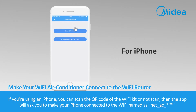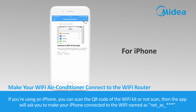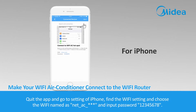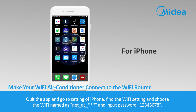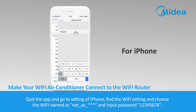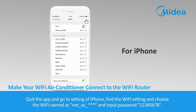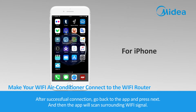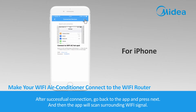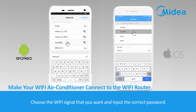If you're using an iPhone, you can scan the QR code of the Wi-Fi kit or not scan. Then the app will ask you to make your iPhone connected to the Wi-Fi named as net_AC_. Quit the app and go to Setting of iPhone. Find the Wi-Fi setting and choose the Wi-Fi named as net_AC_ and input password 12345678. After the successful connection, go back to the app and press Next, and then the app will scan surrounding Wi-Fi signal. Choose the Wi-Fi signal that you want and input the correct password.